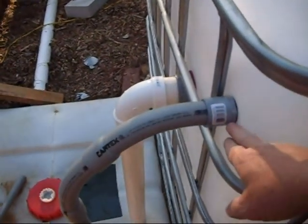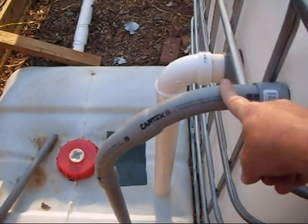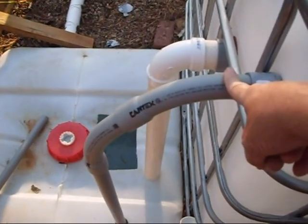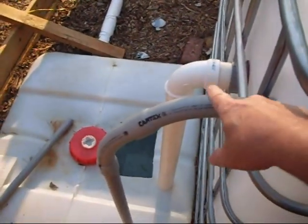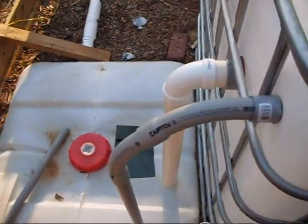Everybody should know by now how I use the one inch male and female fittings with a number 18 O-ring to make my one inch penetrations. I like to use the one inch electrical conduit because the gray PVC is still schedule 40 if you need pressurized, but it's also UV resistant unlike the white PVC, which is not UV resistant. The gray PVC you don't have to paint — it's already UV resistant and stands up a lot longer under sun than the white does.